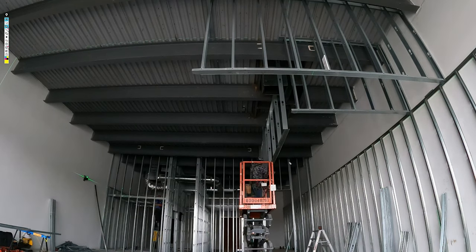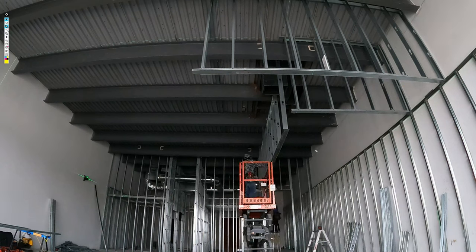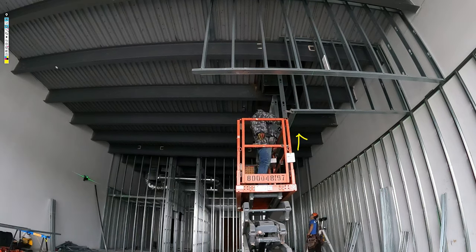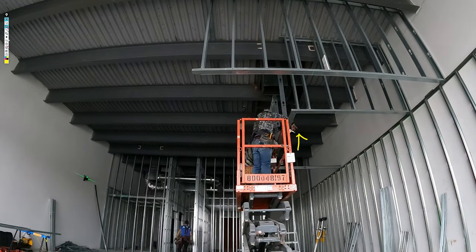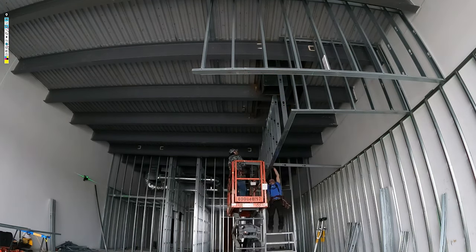I love the 2-inch offset because then I can set both sides of the track, and I'm squaring all my studs and everything, and it's beautiful, okay? So the connections that I'm using to join the tracks together are fishtails. Nothing crazy, right? Just standard fishtails. I have pin lasers also for plumbing them up, sorry. And yeah, I got the line laser for the elevation, okay? So yeah, simple as that, okay?